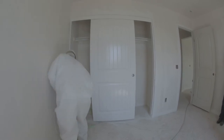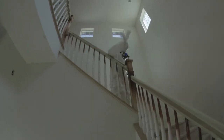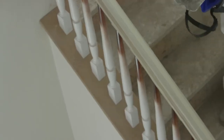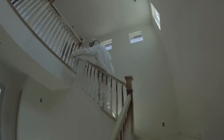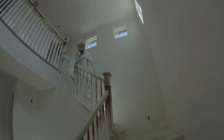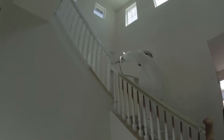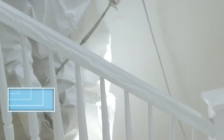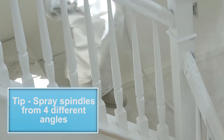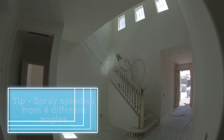Lastly, we will be painting the handrails. Make sure the staircase is clean and free of debris, and that all surfaces not to be painted are masked off. As stated before, proper distance and parallel spraying is a must. Start by spraying the spindles, ensuring there is a good seal on all four sides as shown by the spray man. Spray the spindles from four different angles, dispersing the same amount of paint on each angle to allow for full coverage.